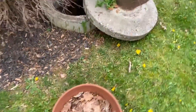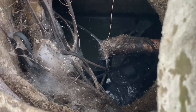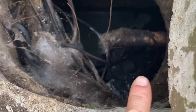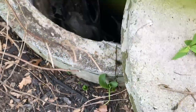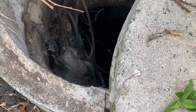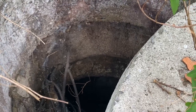This is what we refer to as a pump chamber. As we look inside we can see there's actually a pump — basically this is just a large version of a sump pump. A float down here is what turns the pump on and off, and there's another float that will tell you when the pump has failed. We refer to that as the high water alarm.